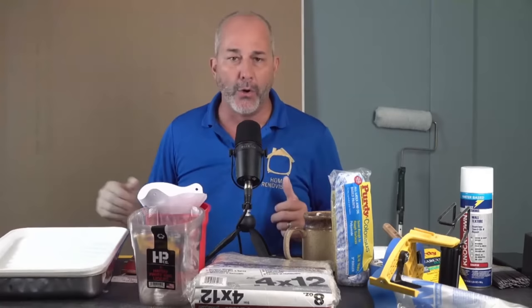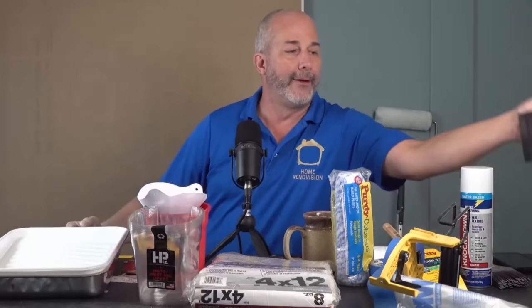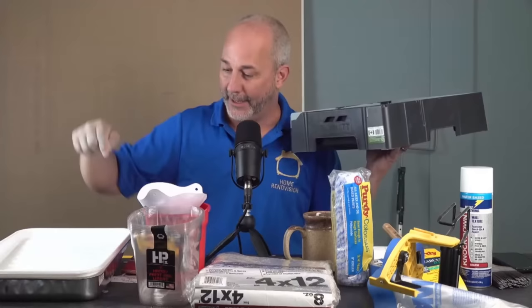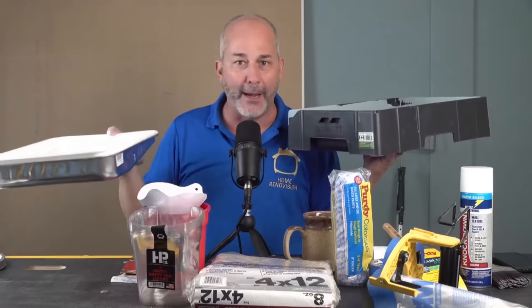Let's talk about trays, because this is one of the things that drives me nuts. This small tray holds one quart of paint — a quarter of a gallon. The tray I use is a full-gallon tray. You open the can, pour in three quarters of a gallon, and what's left is a quarter gallon as your cutting can. That works perfectly every time, and you don't have to buy a separate cutting can. If you save a few bucks on a smaller tray, you still have to buy a liner, plus you can't cut effectively — so you end up buying another cutting can anyway.